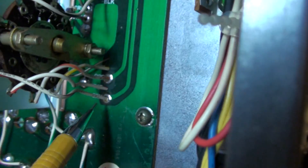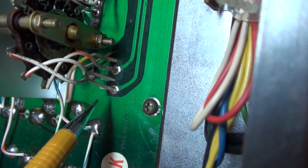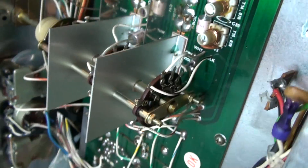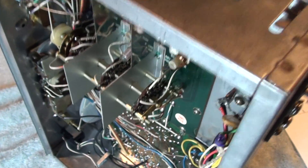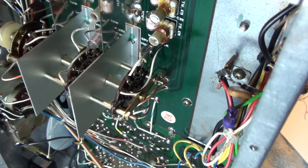Because this is on the band switch — it's on the front end of the receiver — when one or more of these connections fail, you lose signal on the front end. If it's just a cracked connection, it might just be a very high resistance connection, in which case you just have reduced sensitivity.